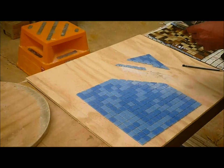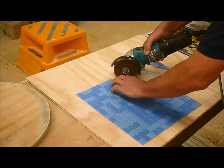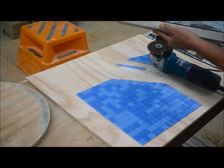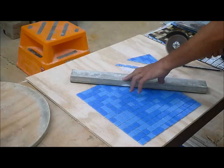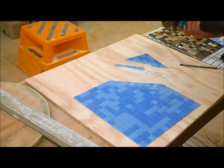The tiles are no longer sharp because with an angle grinder, it's not a cutting tool - it's actually a grinding tool. So it's trying to grind through those tiles and clean it up. You can run that backwards and forwards. Your fingers are getting quite close to this blade. So another thing you can make is a strip - I've got some aluminium tubing that we use off screed bars and knives. I've stuck a 3mm piece of rubber to it from Clark Rubber. I can put that where I want it to cut and run the cutter straight through that, even at an angle. Your fingers are a little bit further away from the tile, which is obviously a good thing.